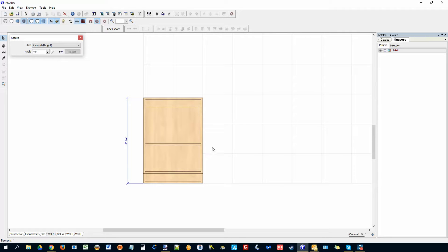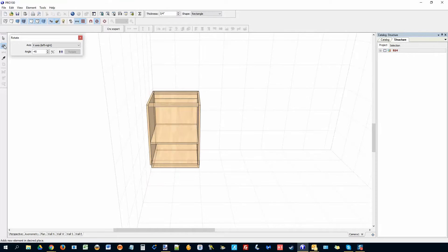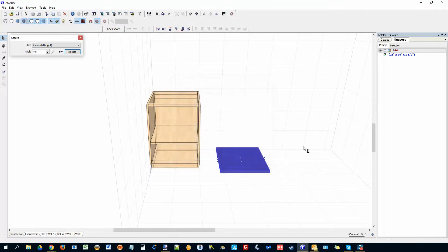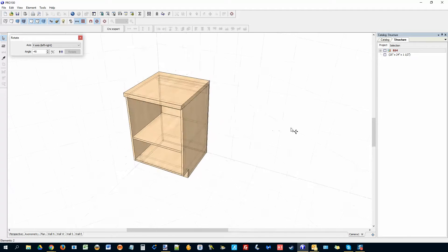It's 34.5 inches high — that's because we haven't put the countertop yet. Let me zoom in so you can see. And it's exactly 24 inches wide — that's good. Now let's make the countertop. Standard is 24 inches deep, 25 wide — height is going to be 1.5 inches. You don't want to lock the width because you might want to resize this cabinet later.